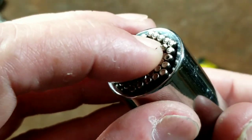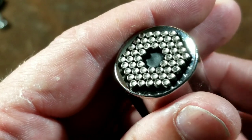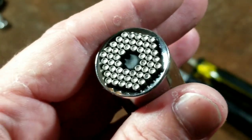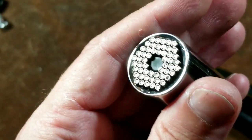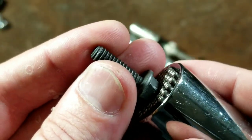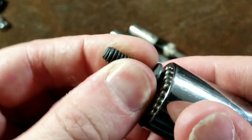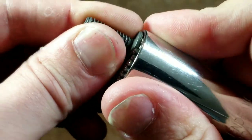That's a little overkill, but it makes it work well. Because of all these little pins, sometimes you'll get it on and it will slip, and then you can just pull it off and put it on in a different position and it will lock up on the fastener. Those red round pins act as flank drives on at least one of the surfaces you're driving. This thing actually hasn't slipped that much on me. A huge advantage is if I want to run a 3/8 fastener, I don't have to be right in the middle of the socket.